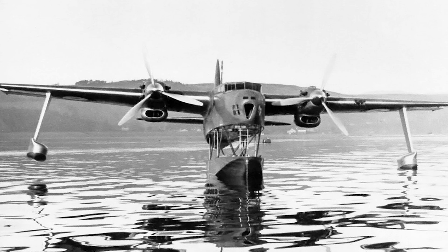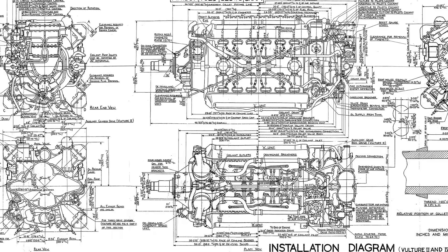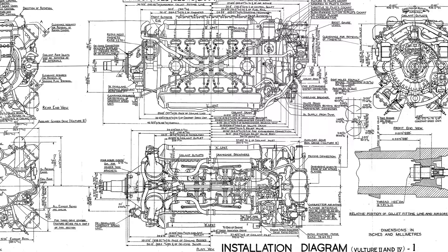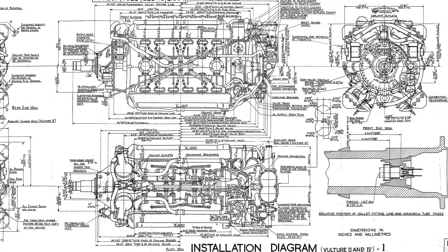Though an innovative design feature, the split hull did result in an increase in the all-up weight, as did various reinforcements to the wings. The prototype was completed unarmed, but even so it still had a nominal weight of 35,000 pounds, or just under 16 tons, which was about 30% heavier than the maximum weight specified by the Ministry specification. This extra weight is most likely the main reason for the aircraft's choice in power plant, because the B-20 used two of the massive Rolls-Royce Vulture 10s, which were 42-litre X-24 engines that produced approximately 1,800 horsepower at takeoff. At this point in time, the Vulture engine was still highly experimental in nature, and it was plagued by teething problems that would eventually lead to the cancelling of its development. However, it was one of the most powerful engines available at the time, and although it was in very short supply, the Air Ministry had specifically supplied them to Blackburn for the B-20, which gives strength to the theory that the B-20 had come out of the factory far heavier than expected.